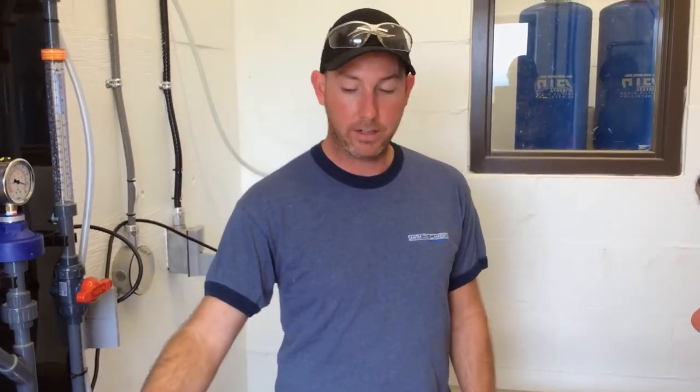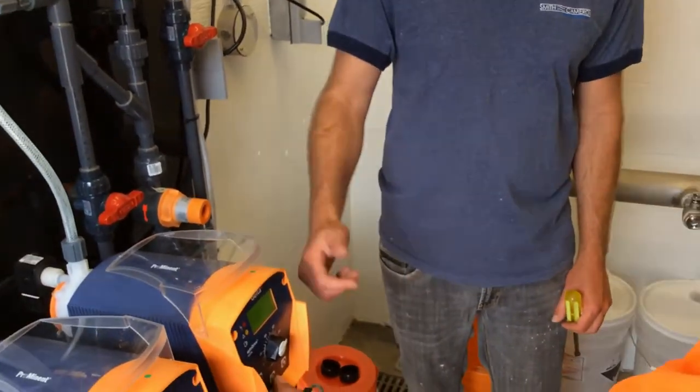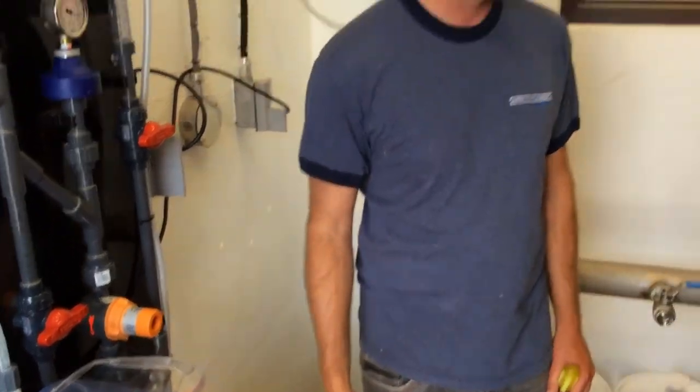Right now, I've got it set to error. It means the pump will stop and you'll get an alarm out. If you went to warning, the pump would keep going, and you'd just get a warning. So if there's too much pressure, I definitely won't pump this up. That's why it's on error. Now, there's a little trick going back in menus. If you press the up arrow once and then twice, you'll go back a menu.